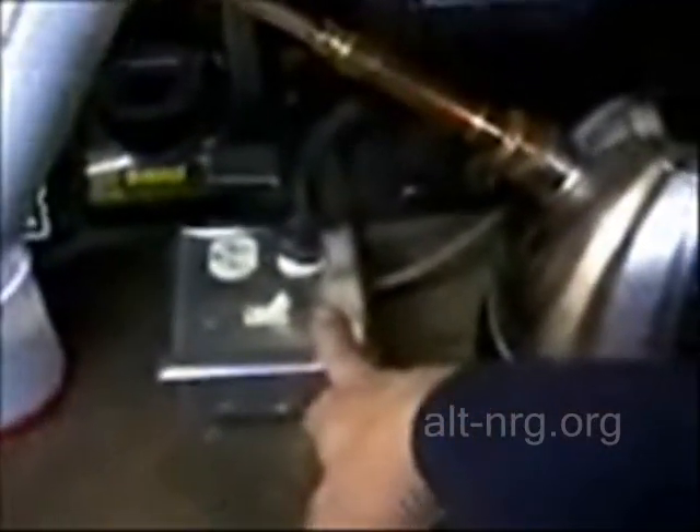This is the poor man's PWM that I created a little earlier. It is a half-wave bridge rectifier which, once I bring the kettle up to boiling temperature, I'll flip it to this position and that cuts the voltage in half and the current in half, which reduces the wattage into the kettle from fifteen hundred watts to three hundred and seventy-five. So it should boil away at a very even pace.